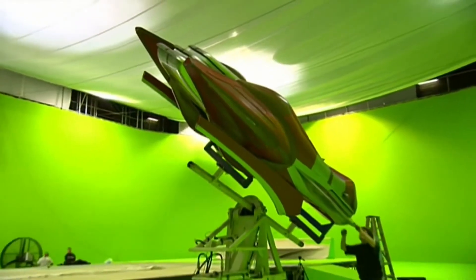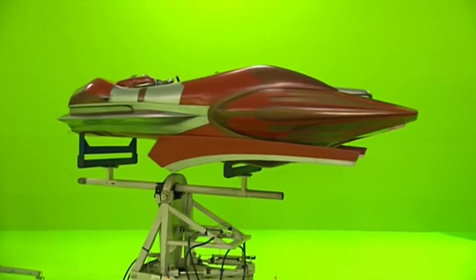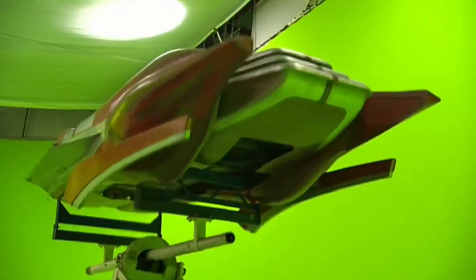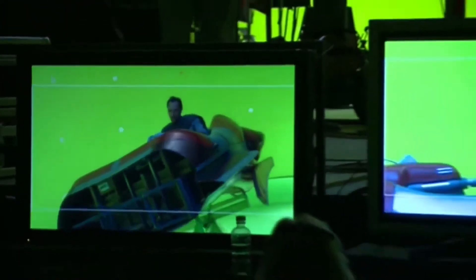We can do a full or nearly 180-degree roll, about 60 degrees of pitch, and about 60 degrees either side of centre. It's the only gimbal I've ever seen that can do that anywhere. We've gone from a fully manual gimbal to a fully computer-controlled one, which means we can completely map the movements that we make and then play back exactly what we've mapped. So when we're shooting, we can change that to alter it, which gives us that facility.